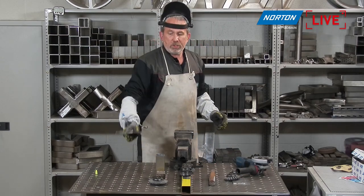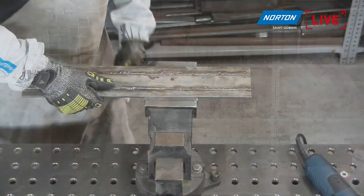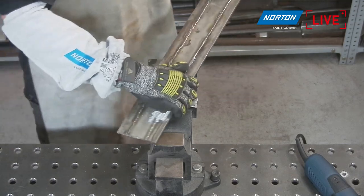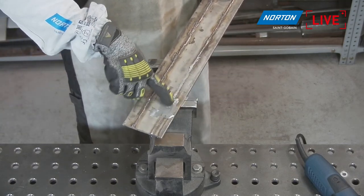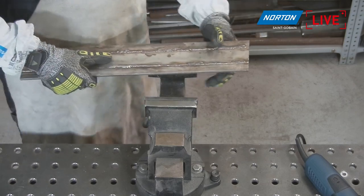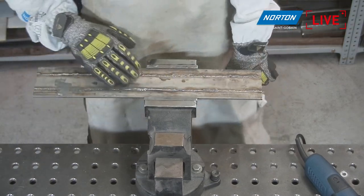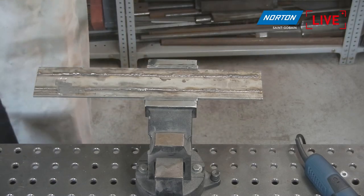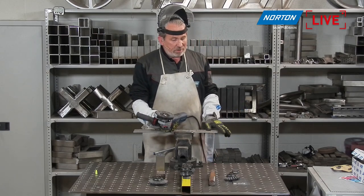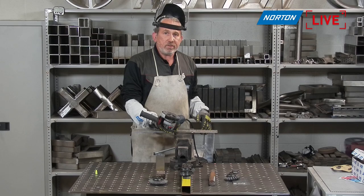What I'm going to use this for, as we said, is cleaning around surfaces that are a little bit difficult to reach. Something like this plate with some welds down it, I don't want to take the weld off. You can see that's actually happened here. Somebody's used a fiber disc or a flap disc to remove the weld. Some people want to remove the weld, but if it's a structural weld and you need to leave it intact but clean it up, wire brushes are absolutely perfect for doing this. You can see it's pretty unsightly, lots of weld burn on there, which doesn't look particularly great. What we're going to show you is how the little fingers of this wire brush are able to get around all the shapes and the contours and the grooves on the welded surface here, and give it a nice clean surface aspect.